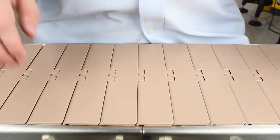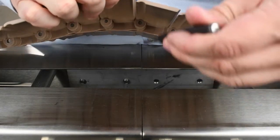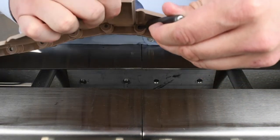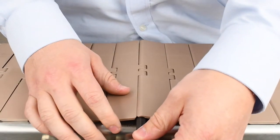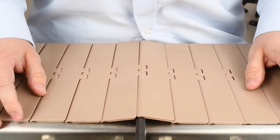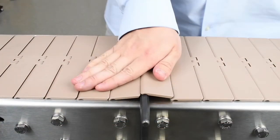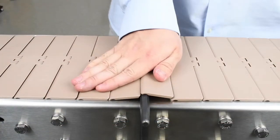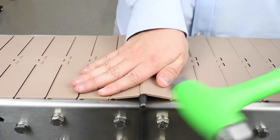When preparing to disassemble the whole belt, you will need to lift it and find the side with the smaller openings. When you have done so, insert your punch into one of the tabs on this side, like so. Lower the belt back onto the conveyor, ensuring the punch remains inside the hole. Press your hand over the punch within the conveyor to hold it in place.